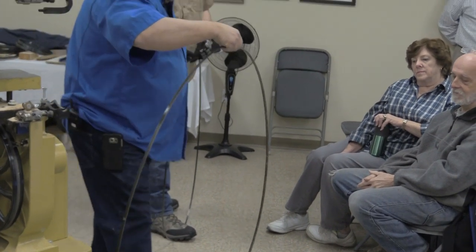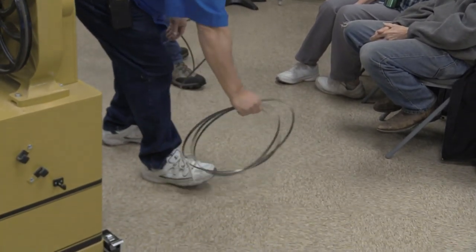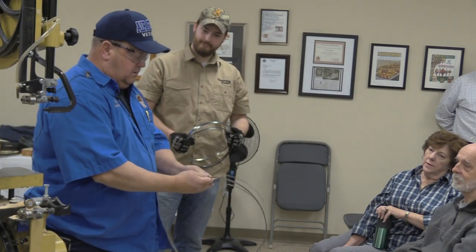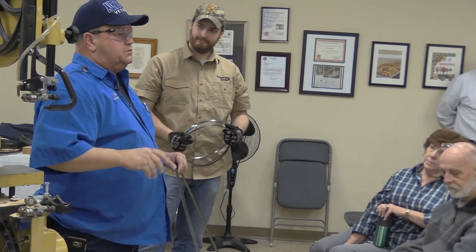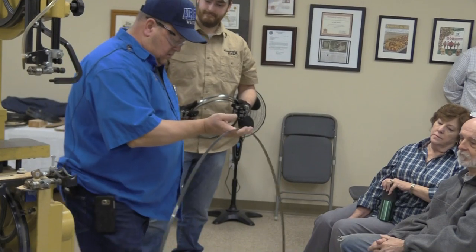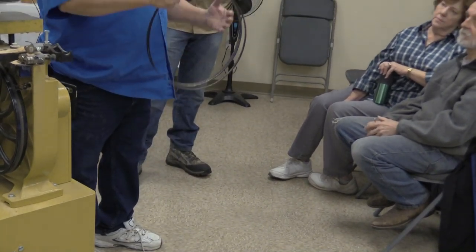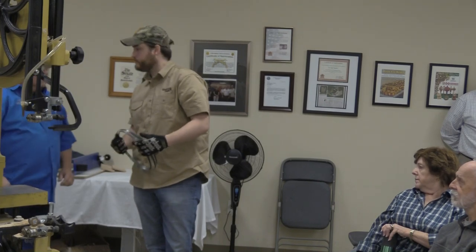There are different methods of folding. I hold it with my hand out, turn it, and turn it again, pushing it down so it folds up. When you go to put it away you can kind of toss it, but look at the outside parts — the big thing is control. Like any tool, if you control what you're doing you're safer. With the bandsaw or anything else, you have to control the stock. I put my foot on it, turn it once, grab it, turn again, and just push down. The bigger blades tend to catch each other so you may need to bounce a couple times.